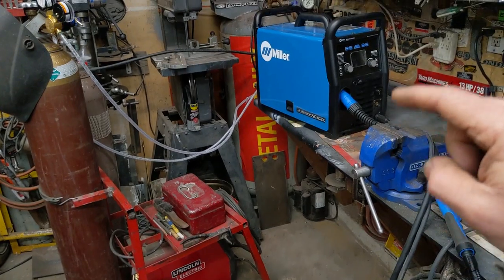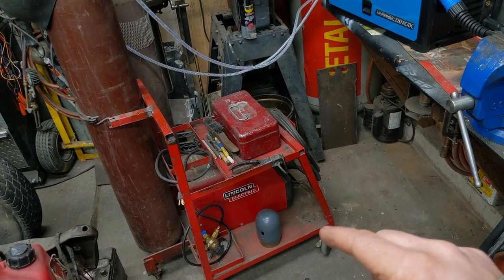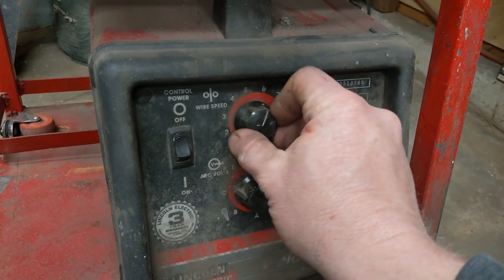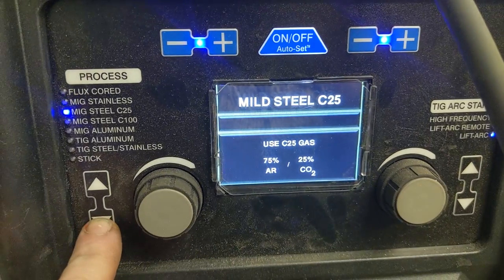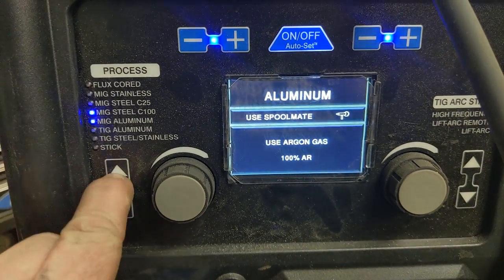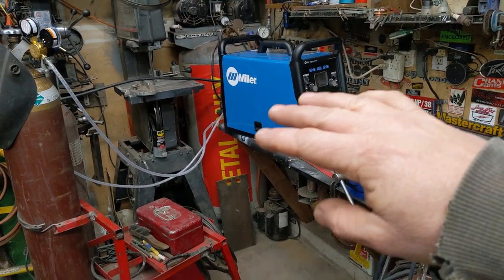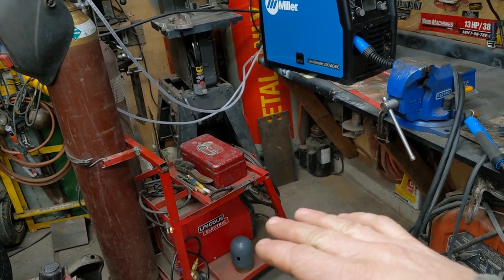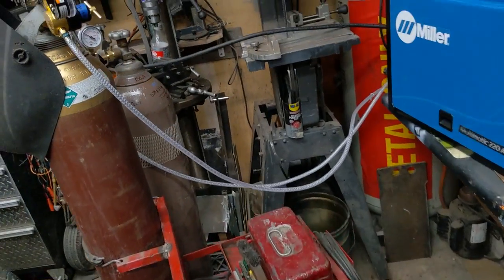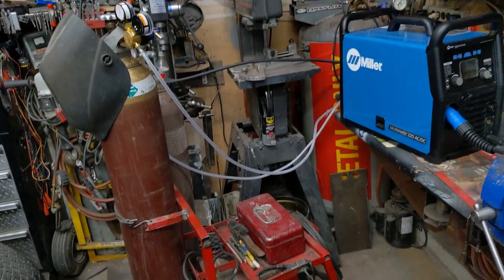A couple features I want: I'm tired of the welder being so low to the ground. My old welder I've used so much it's like a third hand - I can just reach down there and blindly flip the switches. But this new one is so computer controlled you have to be able to see the screen to adjust the dials. So I want to put it at about counter height. I'm going to make a brand new welding cart - counter height, a shelf below where I can put a plasma cutter or other stuff, and on the bottom maybe a big drawer I can pull out. I also need to make it hold two bottles since it does TIG. Let's get at it.